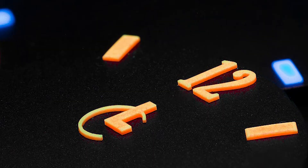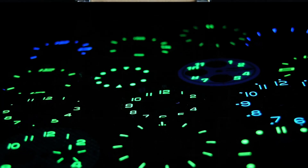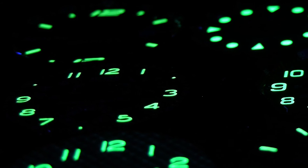It's also a design element — if you can start working with different dimensions, this can look quite nice in practical use. Is there a minimum size for Lumicast pieces? I would say at minimum it should be around 200 to 250 micrometers, and there's no maximum — though you probably don't want a watch case 30 centimeters high. As for structural integrity, this can be highly influenced by the binder system. If you use a less rigid binder system, you can also give it a certain flexibility.